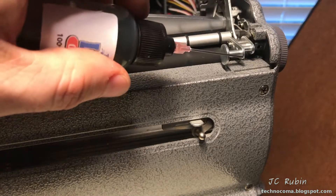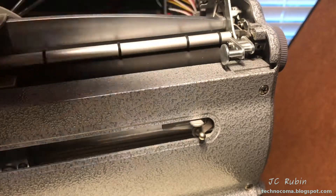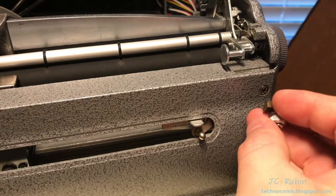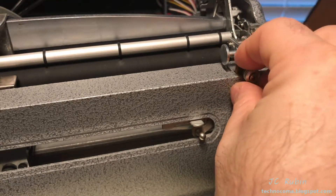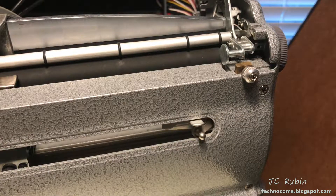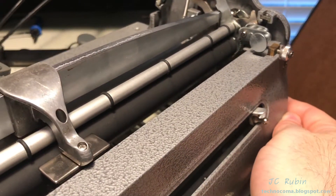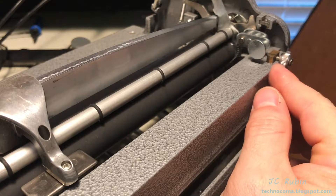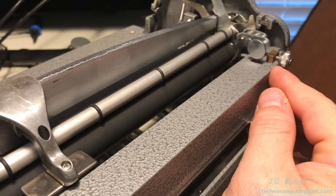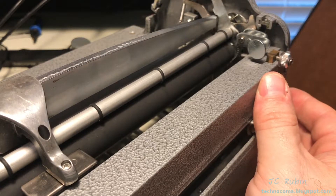Maintenance specifies a little bit of oil in the paper guide slot for installing the paper guide, so I put one little drip and then install the paper guide — just press it in position, give a little twist to tighten it, and it goes just like that. Really nothing to it — it seems awkward to install, but that's it. Closer inspection: it has a clear plastic washer that will be on the outside of the casting. So you have the brass, the thread, the clear plastic washer, and then the knurled metal — sits like that.